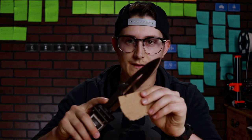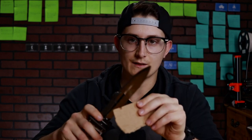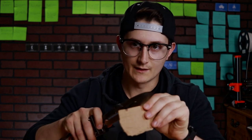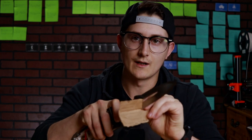Well, it really just comes down to how a basic knife works. If you have a sharp knife, say this thing that I got here, the sharp knife by itself, when placed against an object, doesn't do anything. It's actually the back and forth, or the sawing motion, that allows it to cut. So if you've got something that can cause that knife to go back and forth at an ultrasonic frequency, you're essentially making thousands of little cuts per second. So your cutting force is exponentially greater than if you were ever trying to do it by hand.